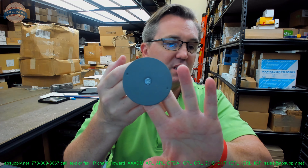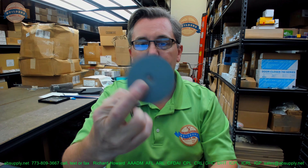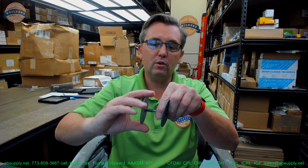The third option I mentioned would be nice is if they had a model that was clipped, because a very common application when you use a hole filler is with a panic device. You've got a 2⅛ inch hole, you're just installing a rim exit-only device — hole filler goes on, exit device goes on — and generally, to get the head case to fit flush, you need to clip or cut that down because the panic device won't sit onto the face of the door and over this plate at the same time. You can make it work, it's just not right to do it that way.